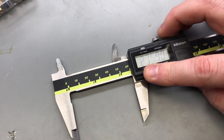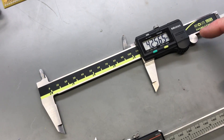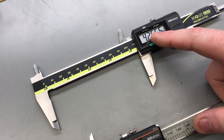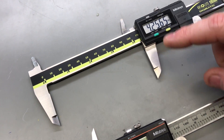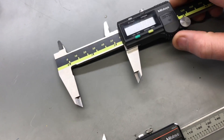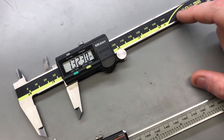With the incremental caliper you have to close the jaws completely, re-zero it, and then go from there. But with the absolute caliper, if I turn it off and turn it on, it knows where it was. The beauty of absolute is not only that if you move it to a position, turn it off, and turn it back on it still knows where it is — I can also turn it off, move it, turn it on, and it will know where I moved it to.